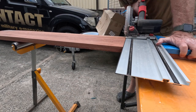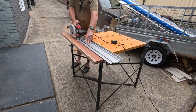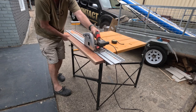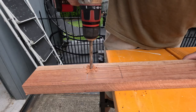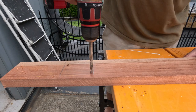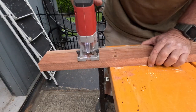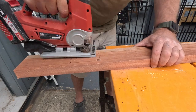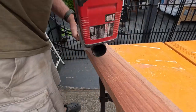That'll finish off the face of the cabinet. Put a nice seam between the two. That'll be flush. I'll make it a little bit proud and then sand it down in place. Then I'll fill this hole with iron bark and I'll make an iron bark boxy shelf going across there to fill up that gap at the back. I think that will add a bit of color, a color splash to an otherwise white kitchen. So that's what I'll get on with.